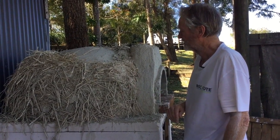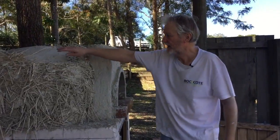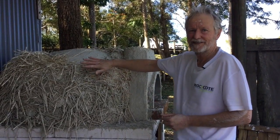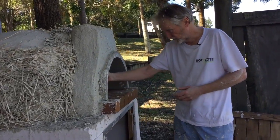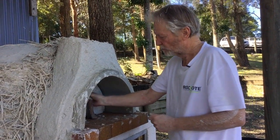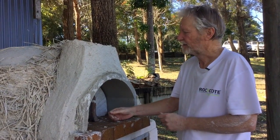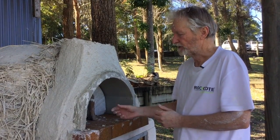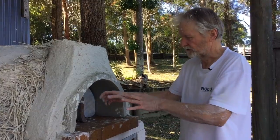It's got enough clay in it so that it doesn't burn, especially when you can't get oxygen to it with the other coat of plaster over it. The layer underneath is the core of the oven that stores the heat from the fire, and this one keeps it in and insulates it. We fire the oven through the door, putting it in different positions depending on how much air we want — we can close it right up or have the fire idling, or take the fire out entirely and load up with bread or roasts.